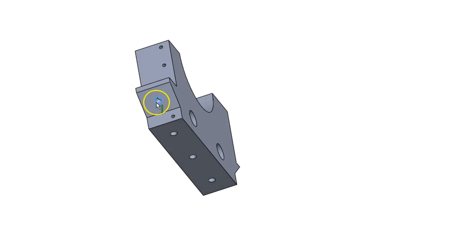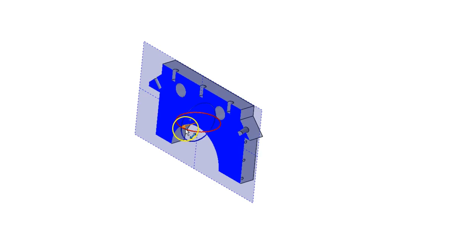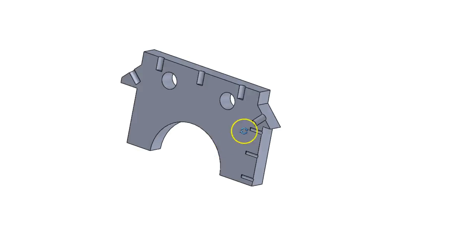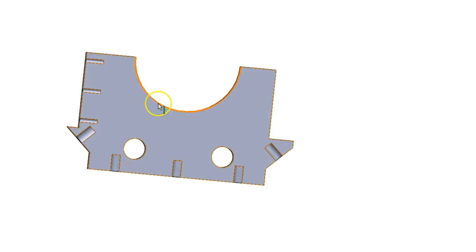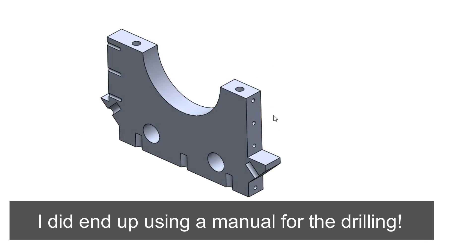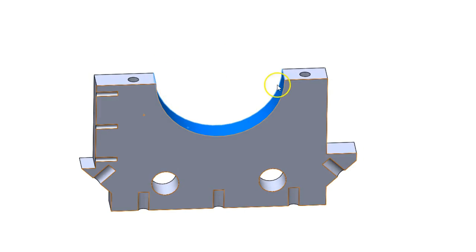A few other things. I've got these 45 degree holes coming in from the side — if you look at that section you can see we're a little tight for real estate. The reason I've got those there is to hold on some splash guards. Ultimately it's a fairly straightforward part, very much a part I'd be comfortable making on a manual machine. I just used the Tormach because it was faster. If I was doing this manually I'd probably do this area with a boring head — I've done that with a fly cutter before and it's fairly straightforward.